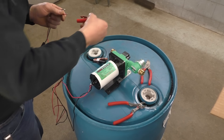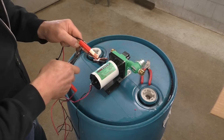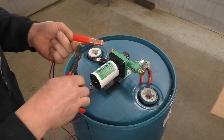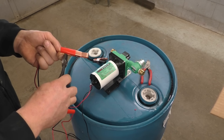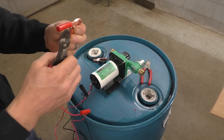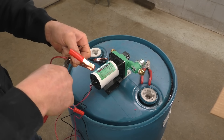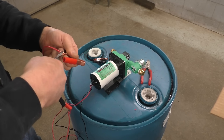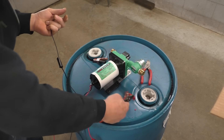Because I'm a man — that's what we do. We'll stick these clamps on here; this is gonna get people's goats. We're just gonna crimp the inner part down onto the bare wire. Got them both bent over, give them a little squeeze. Then ideally the outer crimp would hold onto the insulation — we can hopefully make that happen. The wire gauge is a little small for these clamps, but I wanted to make sure I could get them over a battery terminal easily. Then we'll do the same thing on the black one; I might put a little dab of solder in there just so they don't pull out.